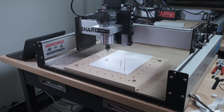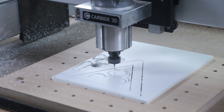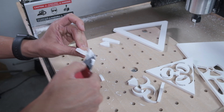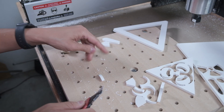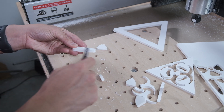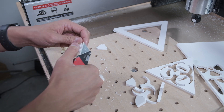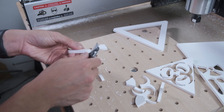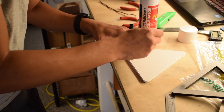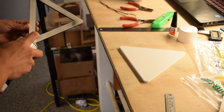The toolpaths ran without any problems after that little mishap. The parts that come off the CNC will probably need a tiny bit of cleanup, but that's easy enough with a sharp blade. A little scraping will go a long way towards removing hanging chips and breaking sharp corners. Not only will these pieces end up way cleaner than I could ever get with MDF parts, but because PVC isn't fibrous, the walls will stay smooth even after painting. There's no grain to raise.